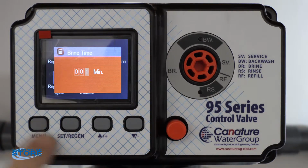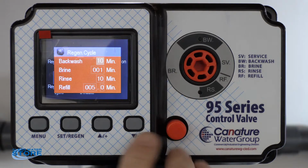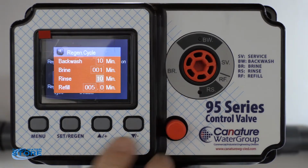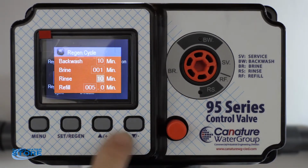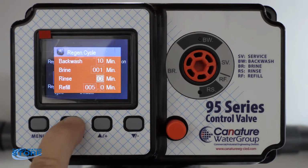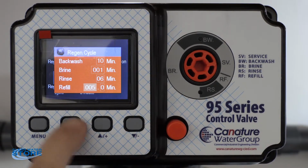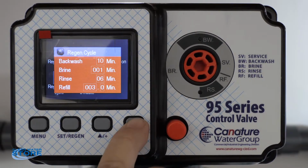Okay, so we'll hit menu again. So our brine's 1 minute, our backwash is 10 minutes. We're going to go down to the rinse. We're going to select that. We're going to change that to 6 minutes. Okay, hit set. We're going to go down to refill. Again, we're going to hit set. We're going to go to 0.